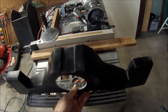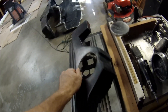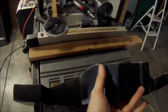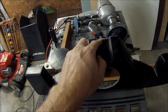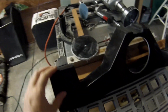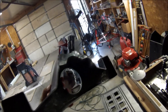I use 180 grit — you can use 220 or 180 grit first, then primer it and then paint it. When you order out of mold, this is how it looks. You might have some little air pockets on the edge; I found some on the other side as well that you have to fill in. None of the parts are going to be perfect. I did trim off the mold line a little bit, but it's not going to be 100% perfect — you're going to have to find the imperfections and fill them in to have a perfect part. That's how it looks in an out-of-mold condition.